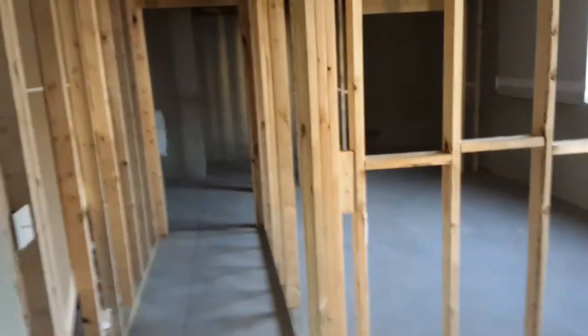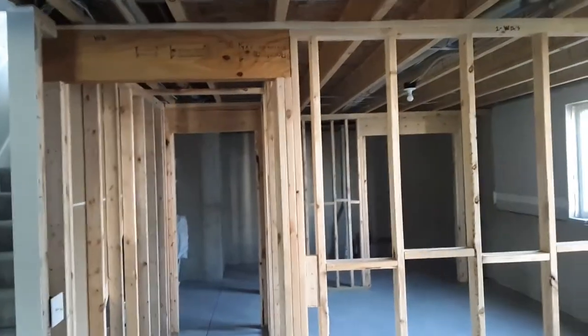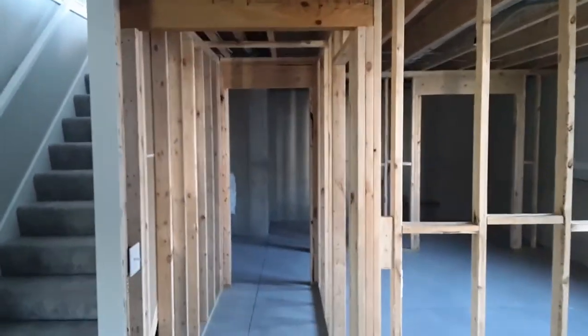Very hollow — very hollow throughout this area. It's almost as if there's no footing here at all. Now in this area here we once again have a load-bearing wall. You can tell again by the header above the door opening, the studs, double top plate, and sole plate. I measured it with a tape measure and this is reading out about 15 feet.